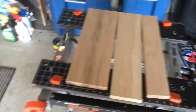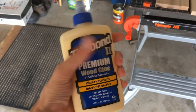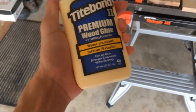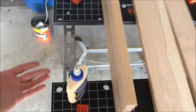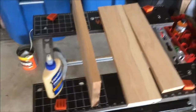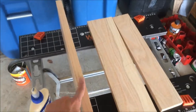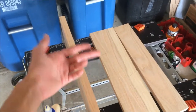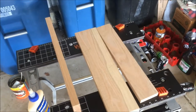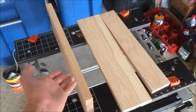Basically, if you've ever built a tabletop or a cutting board, it's the same thing. Titebond II — this is really good stuff. It says stronger than wood, and that is true. A lot of these glues are stronger than wood. I'm just going to put glue on the edge and clamp them together with this workmate table. These boards were jointed at a separate facility since I don't have a joiner, so these edges are smooth. As long as they're relatively smooth, the glue will stick.